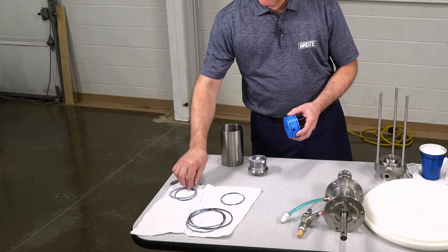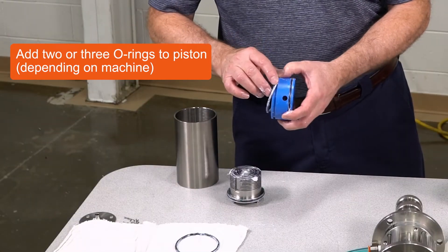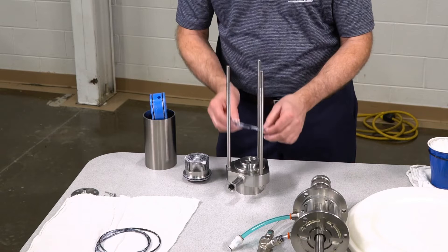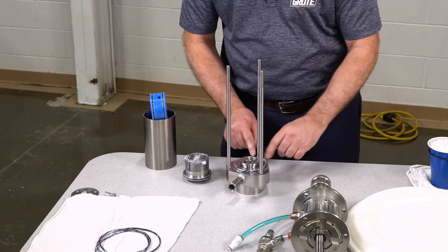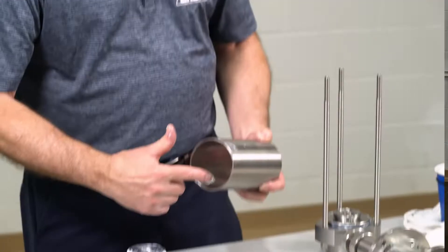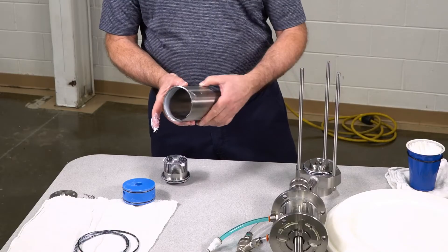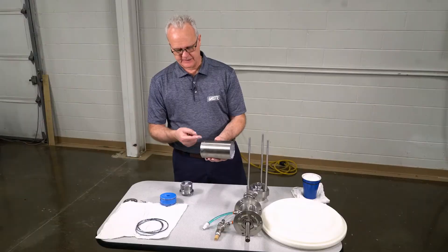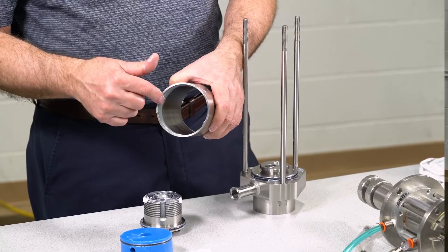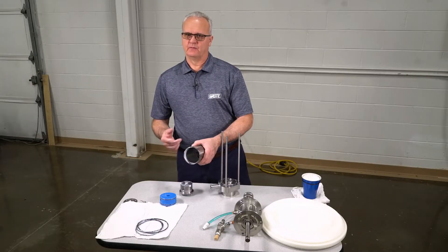Next is the piston. The piston gets two of these o-rings. I'm going to make sure they're on there. This last o-ring goes here and that seals the bottom of the cylinder. Now we're going to grease the cylinder. I'm going to put a thick coat of grease on one side like this, and on the other side just a little bit right here, because when I install this, that end is going to be sliding over this o-ring. The reason I want this much grease up here is so when I slide the piston in for the first time it coats that cylinder, because that's your lubricant to run the pump before it gets saucy.